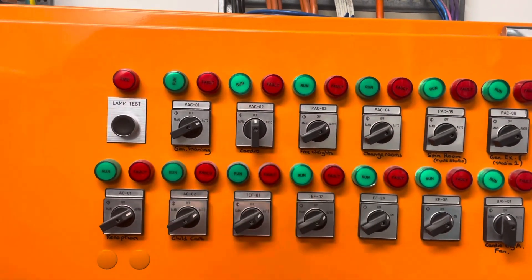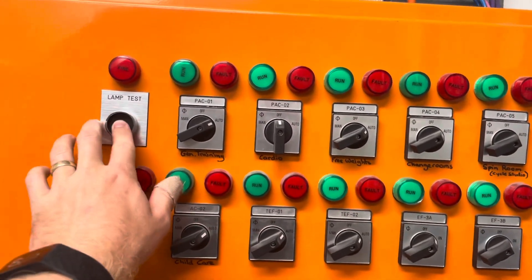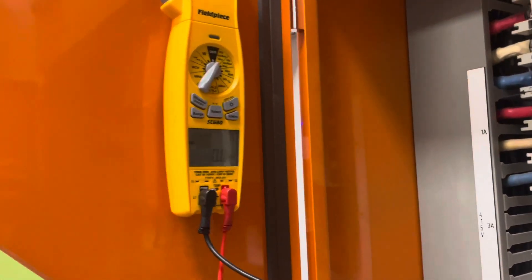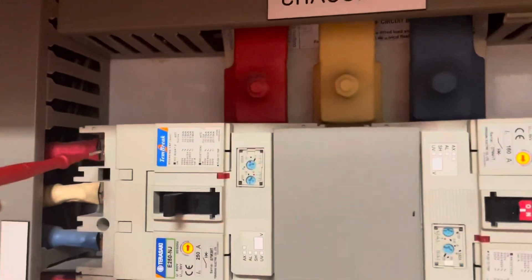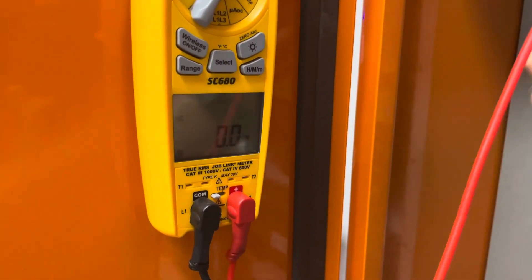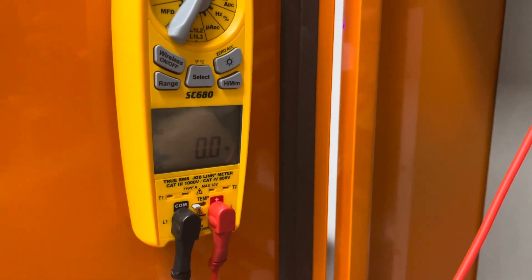As you can see here, we have got no power on anything. Lamp test — nothing, so everything's dead. First things first, I've got my multimeter with my little alligator clip hooked up to earth. I already know that we're dead, but I'm just going to confirm, because definitely no one would be messing around with three-phase power. So we're dead there.